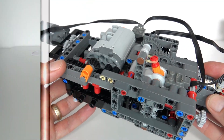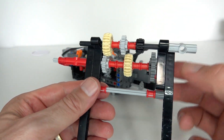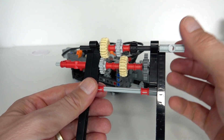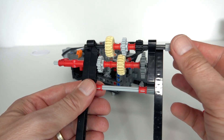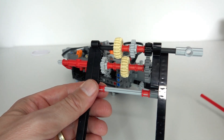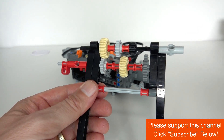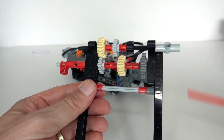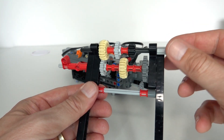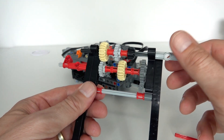First I'll tell you a little bit about the actual gear switching mechanics. What I've got here is just two axles with a series of gears on each. The way the gear switching works is that you can actually move this axle and join different gears together to generate different gearing ratios. For example, if the axle is all the way to the left, we've got a large gear driving a smaller gear - a 20 driving a 16 - giving us a high gearing ratio, so the output on the left goes fast.